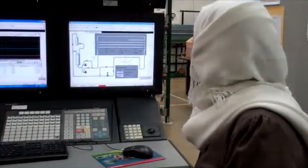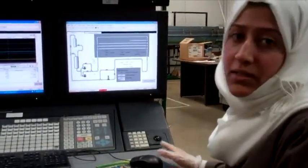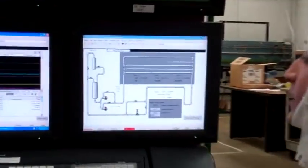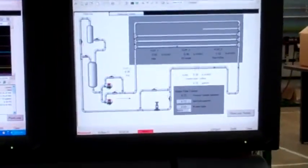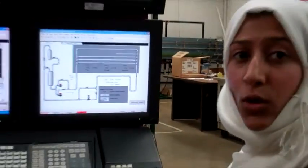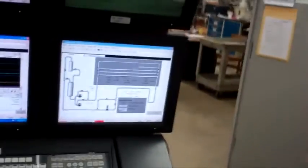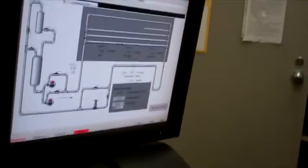Hi, here I'll show you how to set up the Honeywell system to collect data. For the first part, when you choose the pump pipe that you will work with and have all the correct valves open and the others closed, you get to change the set point flow rate at least 6 times and record data for that for each pump.